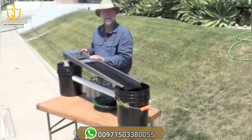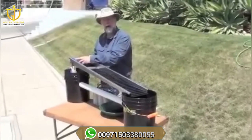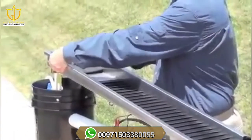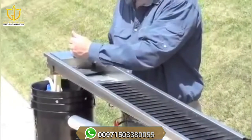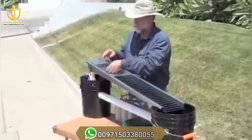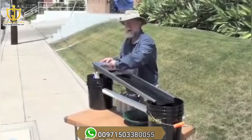The header box is adjustable. When it gets to you it'll be a little bit high. If there are leaks around the edge, just take it with your thumbs and press it down a little bit until those leaks go away. If it somehow gets smashed down — it will in my garage, I can tell you that for sure — just take a large screwdriver, put it underneath, and pry it up just a little bit.